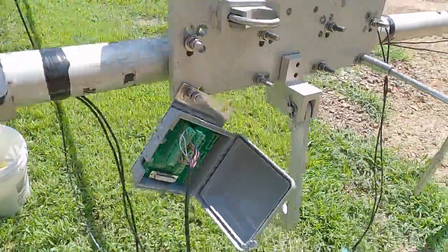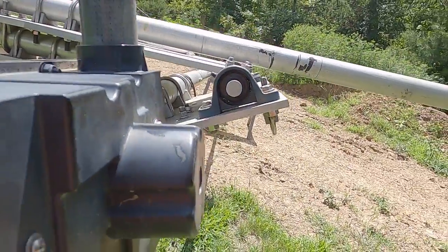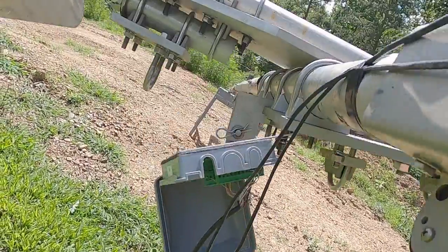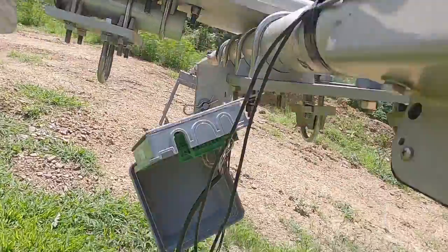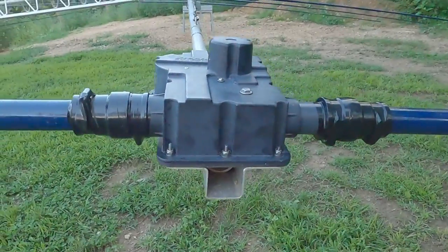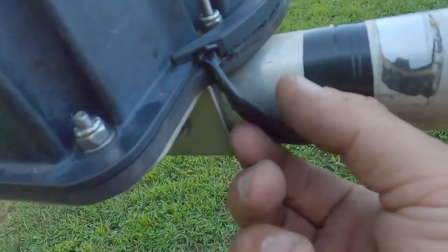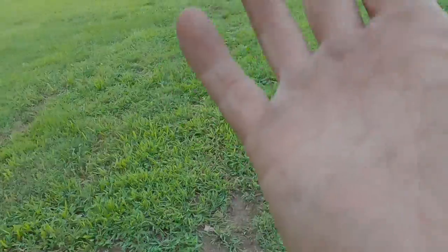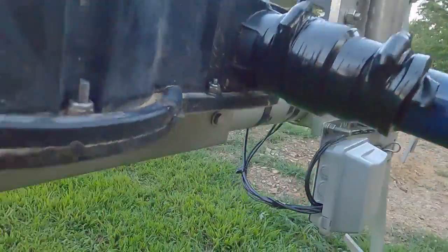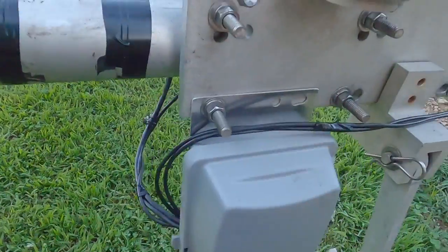There is our control connector box, and this is how it works. When it stands vertical, that hinge will allow the boom to go back on itself — the boom is actually pinched between the mounting plate and the back plate. As it lowers over, it allows the antenna to go horizontal. I've now mounted all of the fiberglass tubes in with the Fernco couplers and taped them — that makes them last longer. I've also put tape on the control wire coming out of the EHUs, and I like to run my wire underneath the boom, which protects it somewhat from the sun. All the cables come to the junction box at the center, firmly mounted to the tilt plate, so as the antenna comes over, that comes with it.